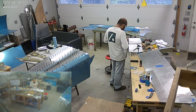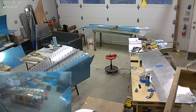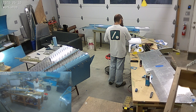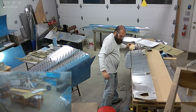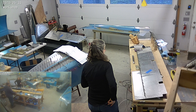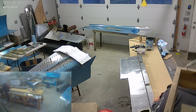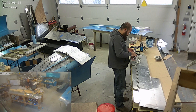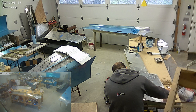You'll see on the table on the left it's starting to get stacked with small parts that are assembled. The left rudder on the table over there is basically done. Now that the rear spar on the right rudder is done, I'm riveting that and getting it together. Mary is helping with the riveting — the rivet line in the middle of that piece is really a two-person job to do right. So we got that done, then I riveted the main spar.